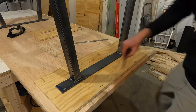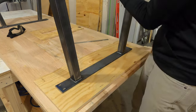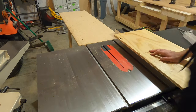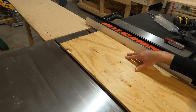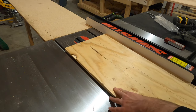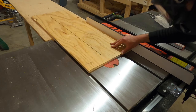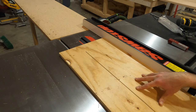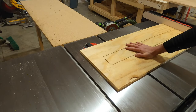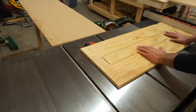I did joint the underside faces of each of the tabletop boards but they were a little bit off as far as thickness consistency, so I decided to make a template and cut out an inlay for the top piece of the leg frame to set down in, which would make everything flush on the underside of the tabletop. To get the lines in the inlay straight I put the board down first, then cranked the saw blade up and made the rip cut halfway through. One important thing to remember: if the blade does not come out far enough, rather than pull the board back you want to crank the blade back down and then move the board into the right position. You always want to push the board into the blade — if you pull the board back you risk kickback.